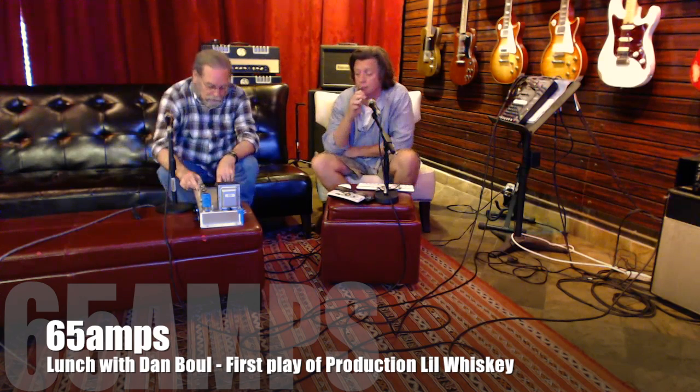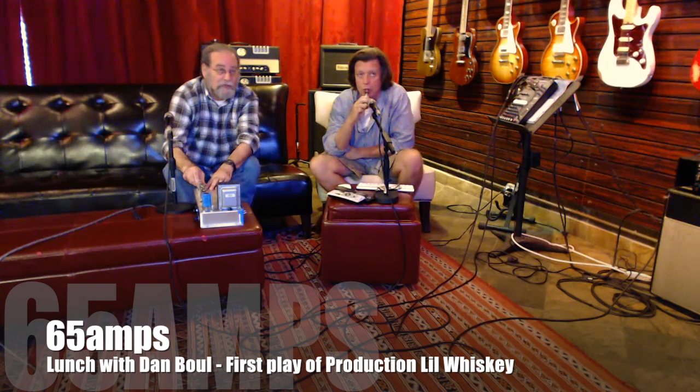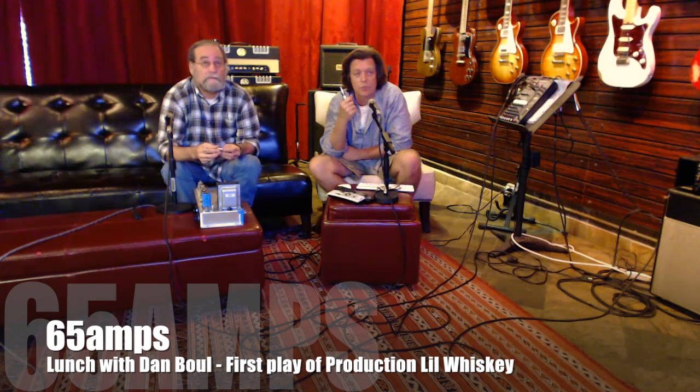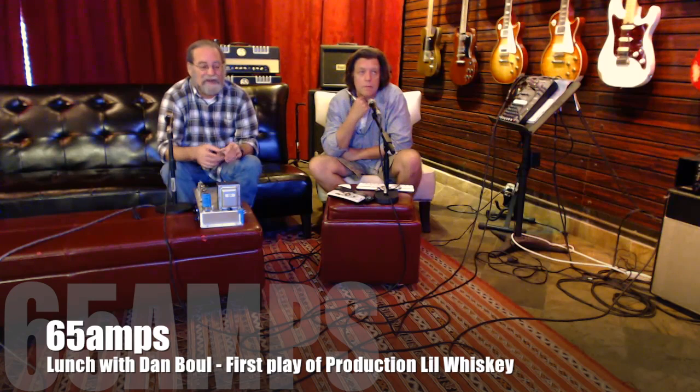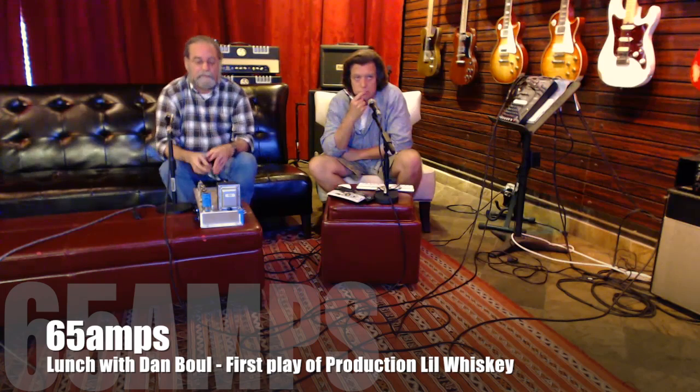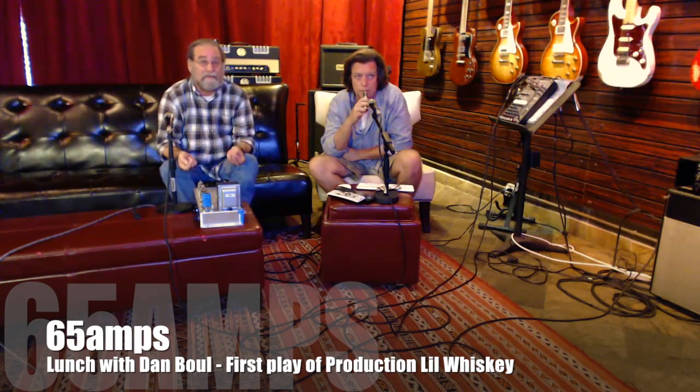Actually, I'm going to steal one of these and give people a little lesson if I can hold this steady up front. Good question for you, though, from Bill's studio. Why does an EL84 sound more musical than an EL34? Basically, they're used differently in the circuit. An EL84 was designed to approximate or be close to an EL34 response and tone in a smaller bottle. And there's certain things you can do, but the construction is different.